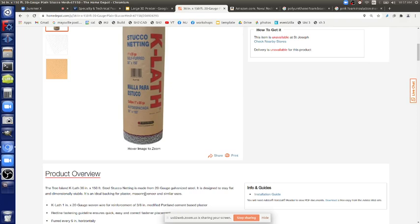You basically have to frame it up, which is easy, but then chicken wire holds the insulation in place. That's actually not a bad idea. And that's super easy. We could do the full U of it and wrap chicken wire and just nail through the corners into the studs. Do you get what I'm saying? Then it will just tag and hold it. You don't have to grab the insulation with the screw. You could have two-foot centers or 18-inch centers like for the batts. I think you could do it full length and just tag it. Chicken wire is safe.